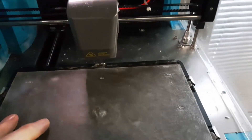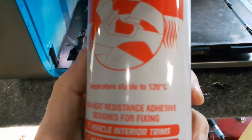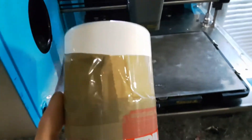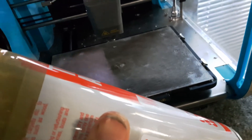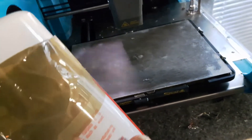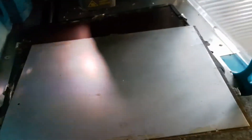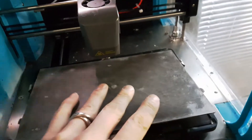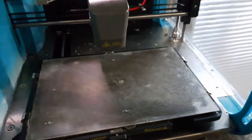If you want to stick with your Revobox PEI sheet you need to bond it to the steel. The way to do that is to use something like this vehicle trim fix — temperature stable to 120°C. It's a spray-on adhesive, a bit like you'd use for mounting cardboard or photographs. It cures and works great at 120°C. Once you've bonded it to the steel there's absolutely no way it's coming off. You can get this off eBay if you're in the UK.